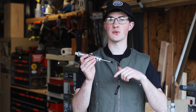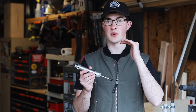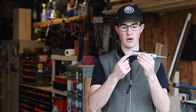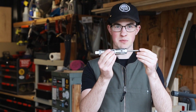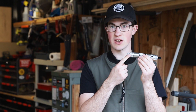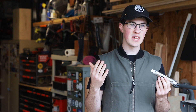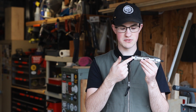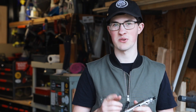What I'm going to do differently is not use a valve, but rather plumb the cylinder straight into the compressor and then restrain the bat with a rope and quick release. I also want to try drawing a vacuum on the exhaust side of the cylinder. Inside the cylinder is a piston — when you apply compressed air to the intake it pushes the piston, and drawing a vacuum on the exhaust side will do two things: one, it'll effectively increase the pressure on the compressed air side; and two, normally if you actuate this with a valve the piston has to push air out through the fitting, kind of like blowing through a straw. A vacuum means essentially nothing to push against, so the piston will have very little resistance.